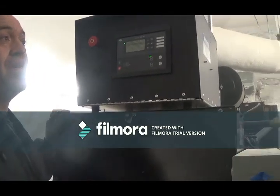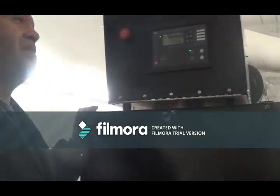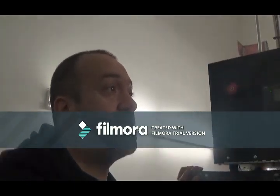This is the semi-annual or the annual? For the annual. The semi-annual is basically an inspection doing a building transfer. The annual is where we change your oil, do a complete inspection of the generator, make sure all the fluids and everything are done, and run the generator at 100%. So for him, weekly,